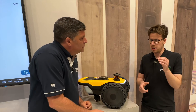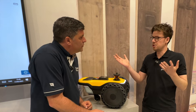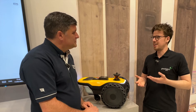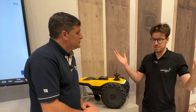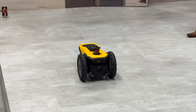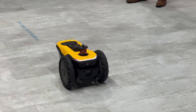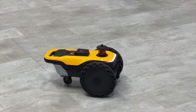Traditionally with a pole and a little detail pole and a prism, we'd set up a construction survey network as usual. We'd be physically on the ground or on a little stool marking the floor. We can try and reference-number that, but essentially it's a bit of a dot-to-dot. We'd be given a drawing with some points on to a gang — clients, site managers — and they'd have to almost interpret what we'd dotted or lined on the floor. We'd have to chalk-line those, or watch other people chalk-line them out. But with this bit of kit, we can literally just print a drawing on the floor.